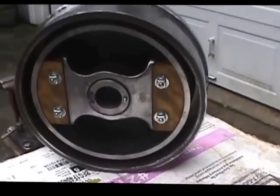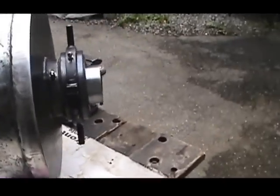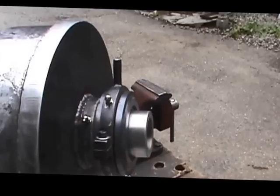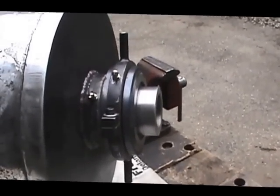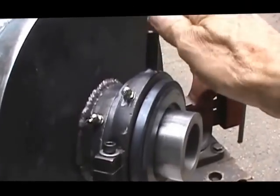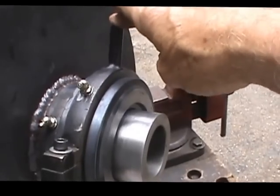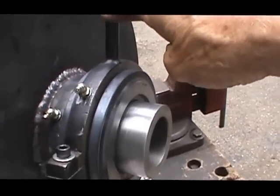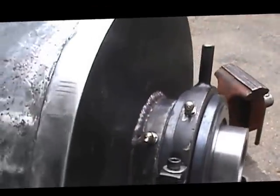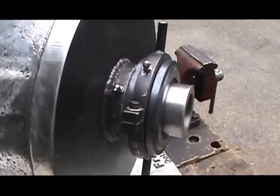The project is going along. We're nearly complete. You can see how it looks on the other side now. This attachment of the clutch linkage will fasten onto these rods on the clutch shifting fork that will engage the friction plate here to the spider once it's all assembled on the hammer.